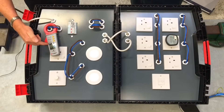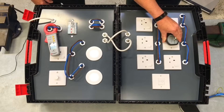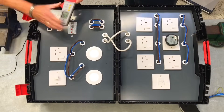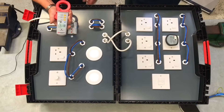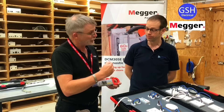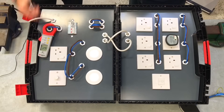At the moment, apart from the last digit, it is a fixed reading - that would mean it's electronics. If I disconnect the socket tester you'll see that reading drop away. If it was actually a fault, the reading you would expect to see would be flashing around - the number would just be jumping around all over the place. The only thing I can tell you is it probably won't be above 22-23 milliamps, which is where the RCD would normally trip.